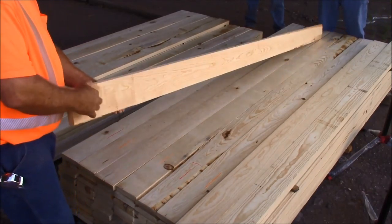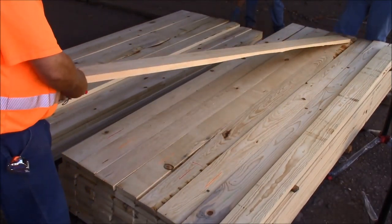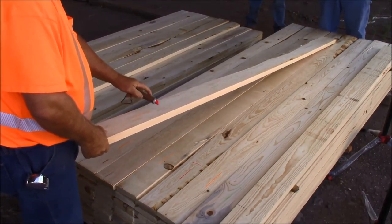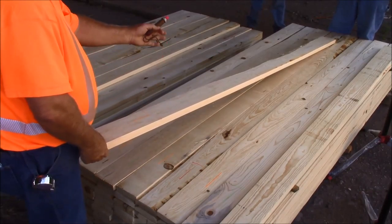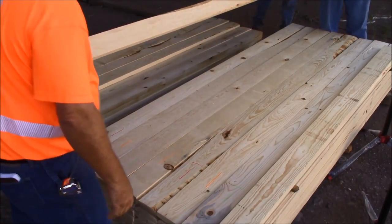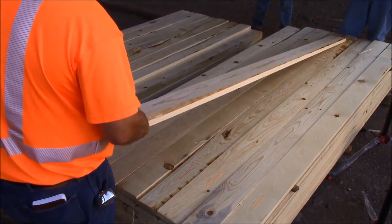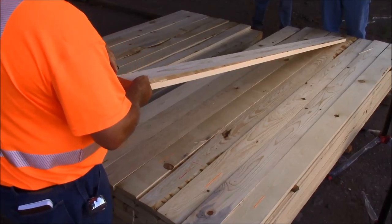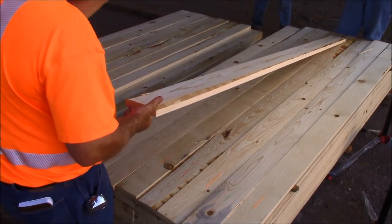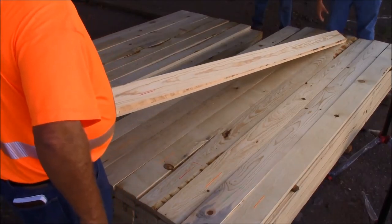This piece here has a beautiful door cutting — that's a beautiful piece of 2 shop. Same here — we have a nearly 42-inch cutting there, but we do have machine damage, so that cutting is short enough that the grader put it in 3 shop. We would have to take that as sash cuttings in between the wane and on the other side. So it's a piece of 3 shop. This board here — because there's no defect in it other than the wane, it has full length clear rips, so we would take that as molding rips. You have to have two-thirds of volume in 10-foot and longer rips. We've got about 70 or 80 percent of it in 10-foot and longer clear rips — a nice piece of 3 shop for molding rips.